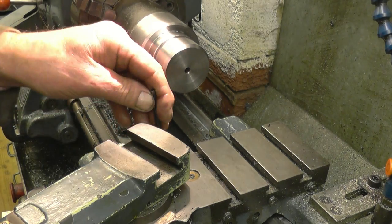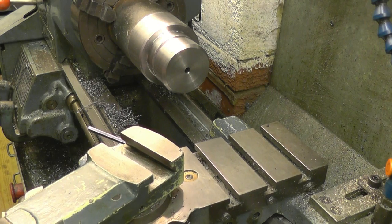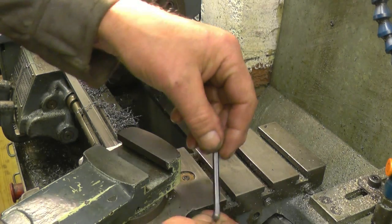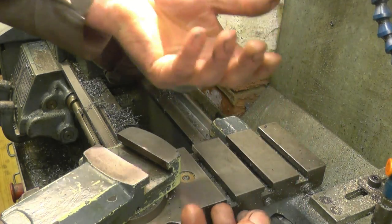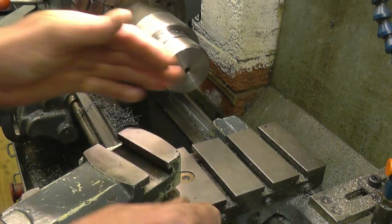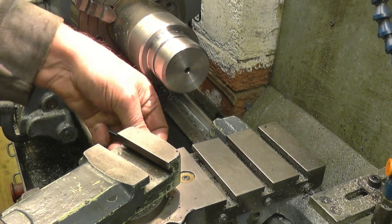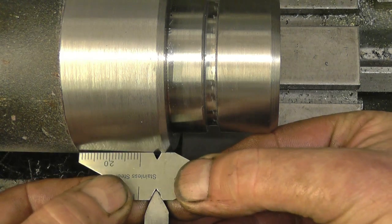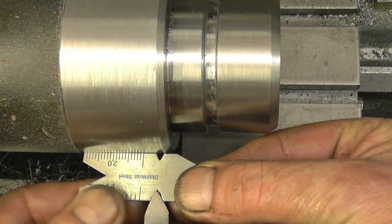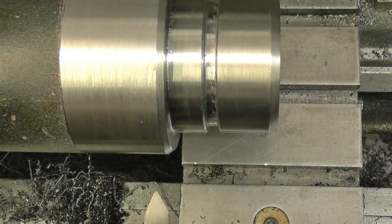So we'll lock the slide up. It means you'll be putting the cut on with the compound slide and pulling the tool out with the cross slide. With it being such a short thread, I'll just reverse the lathe — I wouldn't bother disengaging the feed screw. The lathe runs through an inverter and can be reversed easily. Next thing is to put the tool in and make sure it's set square to the job. It's already on centre height. We've got the tool fitting nicely into the little template, and the jig is nice and square against the job, so the tool is at the right angle to cut the thread.